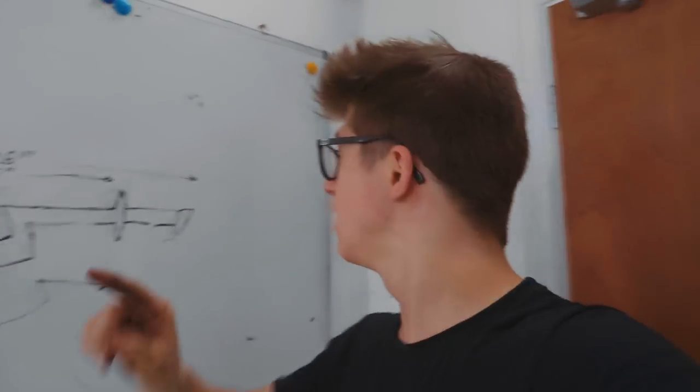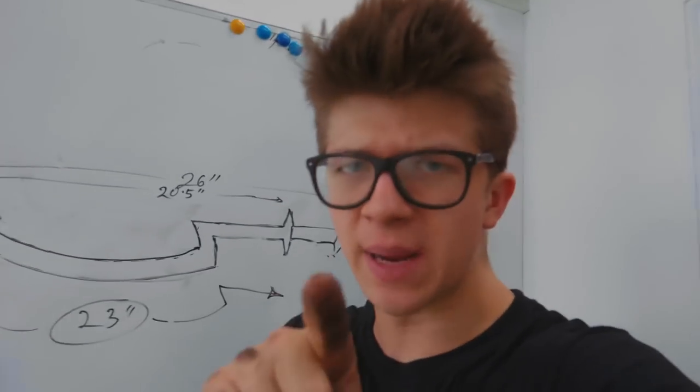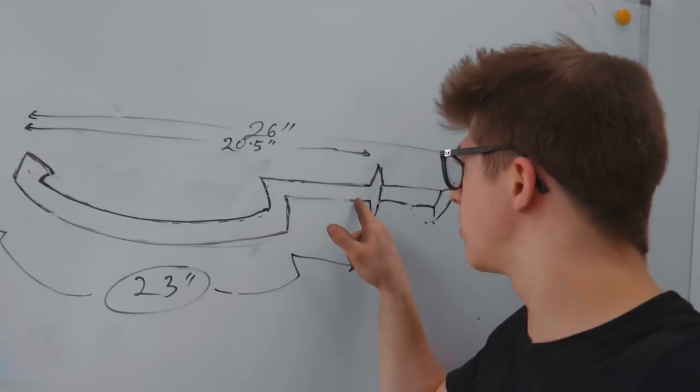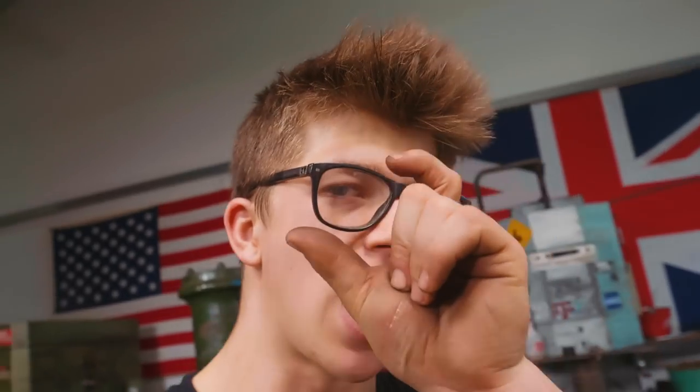Okay, so I have upset some mass there, which is gonna work nicely for the guard. I'm starting to be a little bit hesitant as to how well the integral pommel's gonna work. I might not have enough material for that. We'll see. For now, however, and I don't have to make the decision on the pommel yet, I'm going to work on the isolation here between the blade and the guard on the blade side of the guard. It is in the forge, and I'm gonna run to the light green power hammer over there. It has a little narrower dies, and that means I'm gonna be able to get in there, work it down some, get a better idea of how well that's isolated.